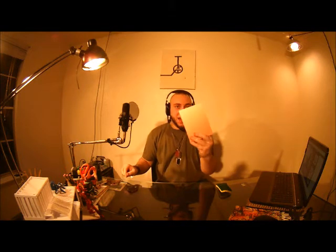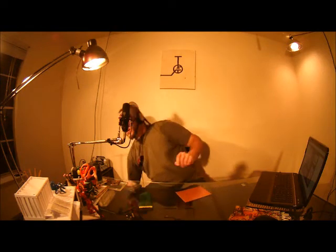This is a two-sided board because that's what they had at the store. I actually made some of this myself out of fiberglass, but if you just want to get a circuit out the door I suggest buying some. When you get the board there will be a little film on the copper — that's where the Scotch-Brite pad comes in. Take it to a sink and just abrade the copper a little bit to expose some fresh copper. After that, get out your isopropyl alcohol and paper towels and wipe off the board so it's nice and clean with no oils or oxides that would affect the etch.